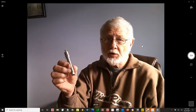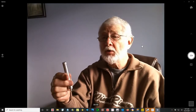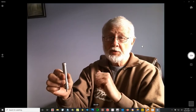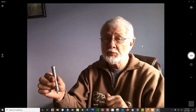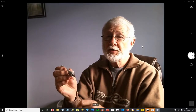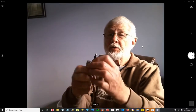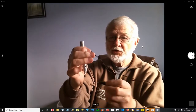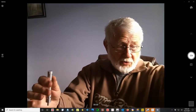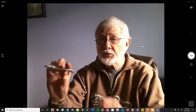I just finished making this electronic edge detector. The way it works is you put it in your machine chuck — say you're using a mill. The body up here becomes connected to your entire machine and your job, whatever is on your machine. This little point down here is isolated by some black plastic — it's not connected. Once it becomes connected, it lights up. We can demonstrate that with just a clip: when we touch down here you can see the light coming on. It wasn't too hard to make, especially the machining part, and we're going to go through the steps on how I did that.